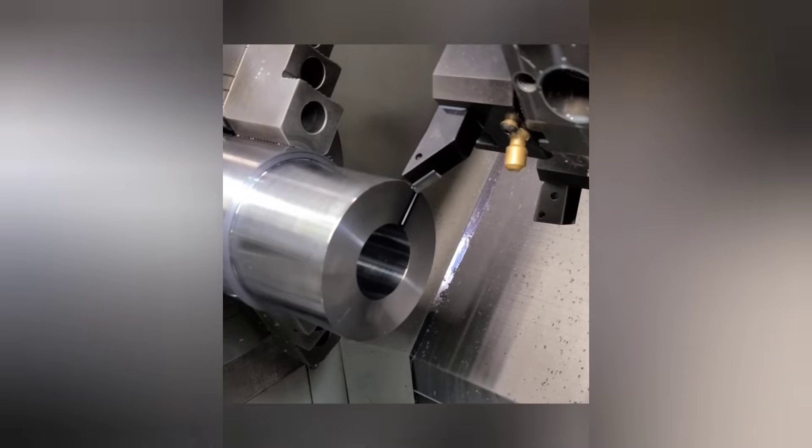There are a lot of ways to set up a boring bar, but one way is to grab a line with a tool that's already known to be on center and align the tip as you see here.